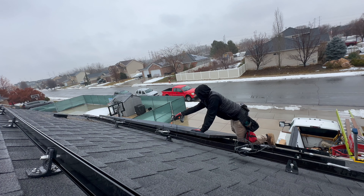Now it's time to set all the panels on the roof. This might look like the hard part, but it's not. If you take your time on all the attachments and make sure they are level and straight, everything's torqued down, and your wire management is good, the panels will go in pretty quickly. I appreciate you watching this video. I hope it was helpful and I'll be excited to make the next one for you. Thank you.